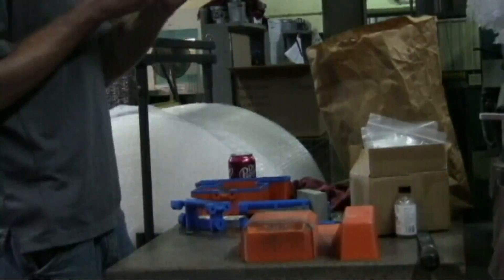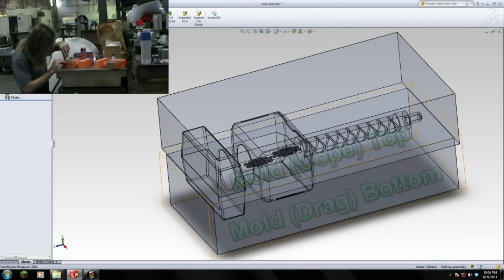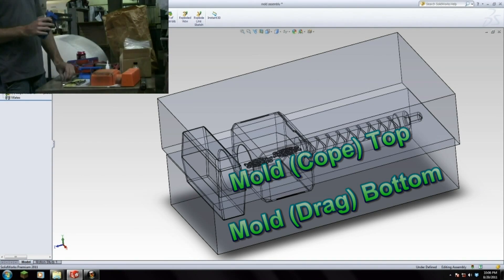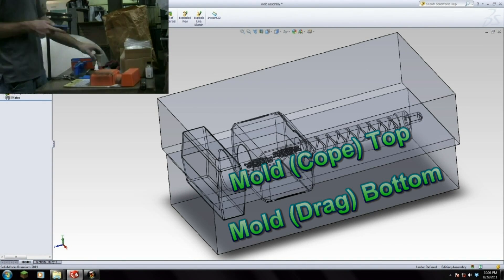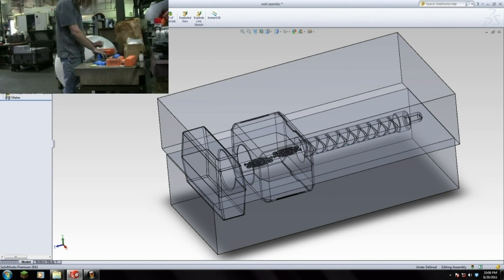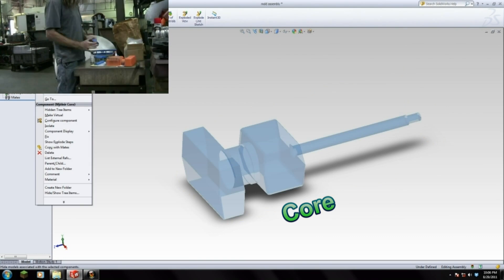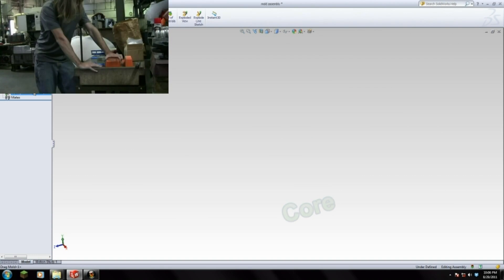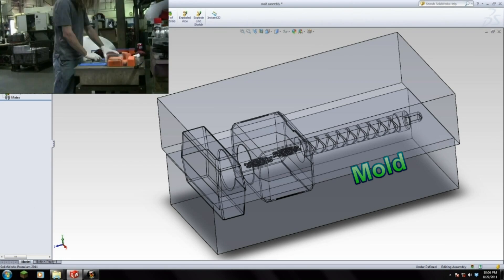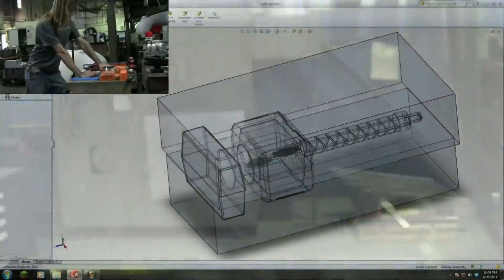Now while I'm assembling in the background, I'd like to explain how patterns, molds, core boxes, and cores work. In order to make a casting, you need a mold. In order to make a mold, you need a pattern. The parts that I'm assembling right now will be placed on a board and will make a mold similar to this. In order to make the part hollow to reduce weight, we need to make a core. The core will be made out of the core box and placed inside the mold. When the metal flows into the mold, it will harden around the core. Once you pull the part out of the mold, you just have to knock the core out — which is made of sand — and you're left with a hollow part.